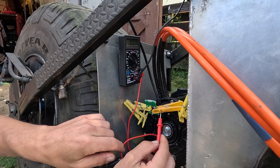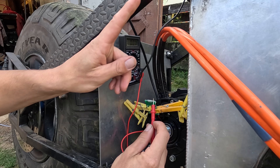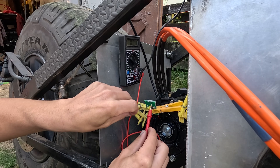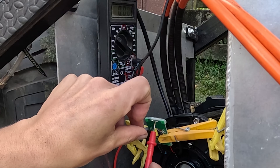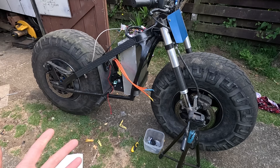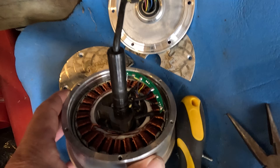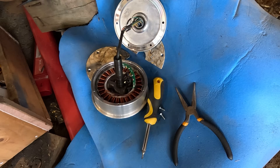Shout out to the wife — she had a great idea to use clothes pegs to hold this thing. The black is jammed in the black up the top because it's easier. The power comes in through this pin here — the meter will go up to 6.4 volts — and these ones are the sensors. Nothing. I'm pretty sure all of them are bad. I think all the hall effect sensors are broken. I tried to pull one out of this hoverboard motor but they broke apart when I tried to get them out — they're glued in there. So now I've got to wait about 10 days for some to come from China.